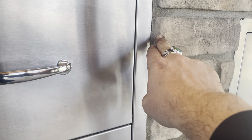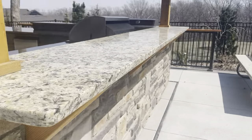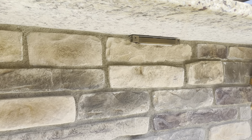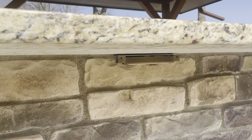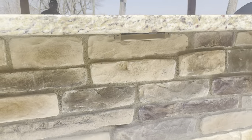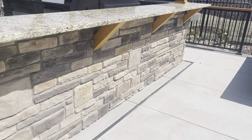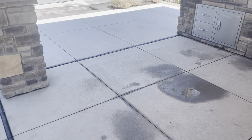On the back side, the little under-counter lights tuck up under the overhang. Always make sure you have enough countertop overhang so those lights hang far enough out that the stone doesn't block them. Know your stone depth, your light size, and make sure the countertop overhangs past both. These lights actually rotate — this whole band will rotate out, so if you have undulating stone you can kick it out for more ground effect, or face them down for more wall effect.